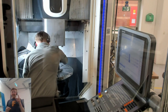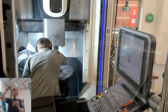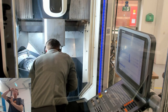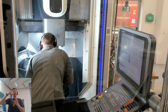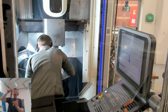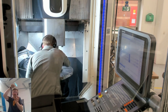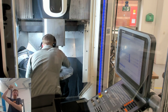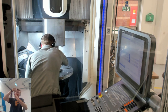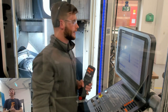That's it. And a really key thing here, a top tip, is never wind the machine down with your block underneath. I would bet a lot of people on this call have been victim of that, and they've damaged either the tool or the block by actually winding it down onto it. Always have the block to the side, move the tool down, and then move it underneath. Never have it underneath and wind down.